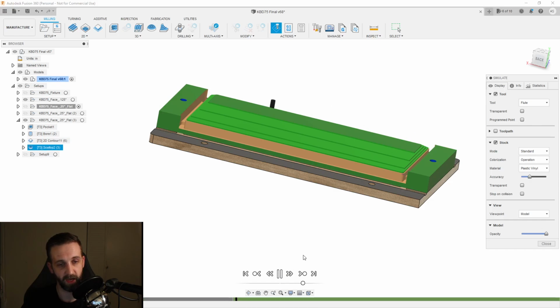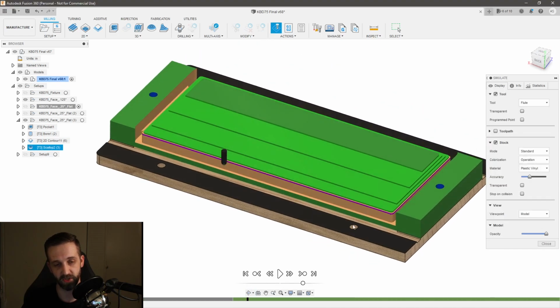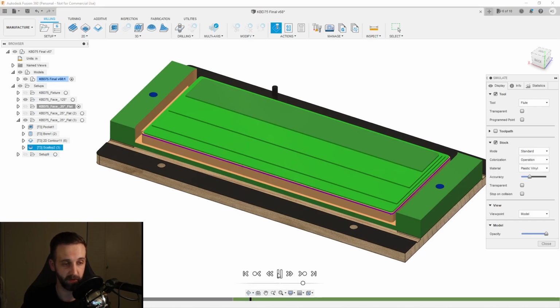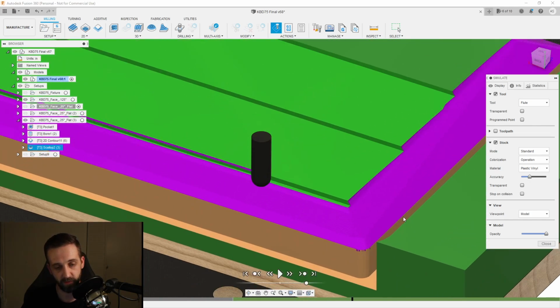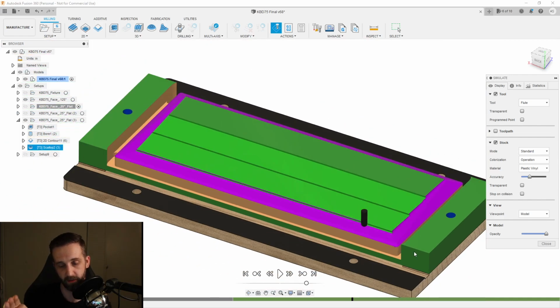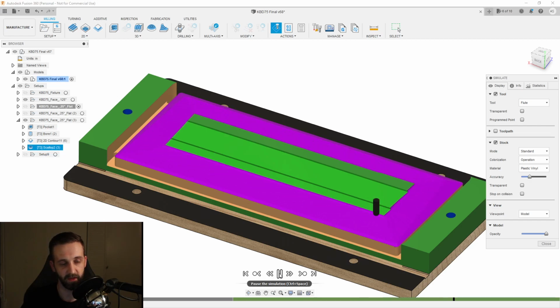Okay, and now it's going to go to its 3D toolpath. So now I did my second tool change to my round over bit, or not round over, I keep calling it that, my round end mill. And I did a scallop toolpath, so it's going around the perimeter each time, stepping up a little bit in Z and in, and offsetting both an X and Y, so that it's going to clear out that material.